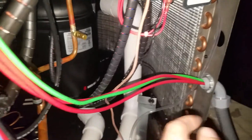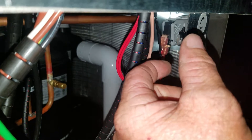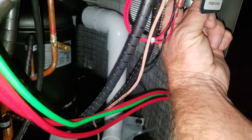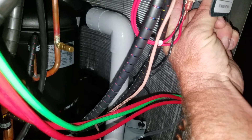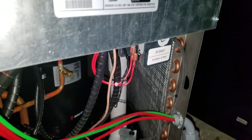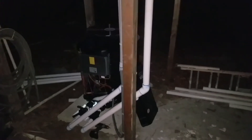From the vantage point of coming into the switch from behind, you're not turning it clockwise — you're going to be turning it counterclockwise. I'm going to turn it just a little bit more to be on the safe side, because otherwise late at night when this pump turns off, the heat pump continues to try to cycle itself on and off, which is obviously not good for the pool pump or the heat pump.